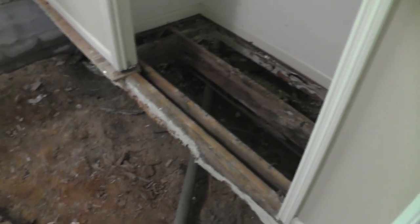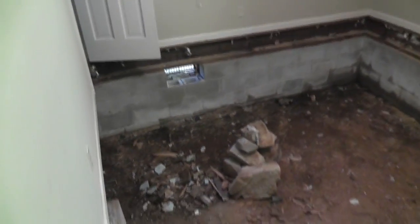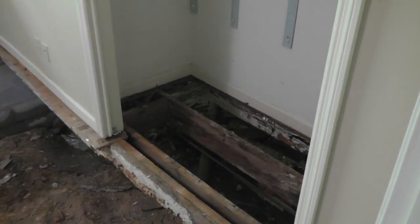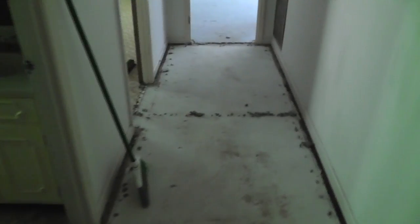This looks like a normal room — check out the closets and light fixtures. But there's no floor. We had to tear all the joists out because they were dry-rotted very badly. The old ductwork is going to have to be replaced too. Zooming in, you can see what the joists were like — they were basically ready to fall in. That back corner is a good representation of how dry-rotted they were. The hall was affected too and will eventually need to come out.